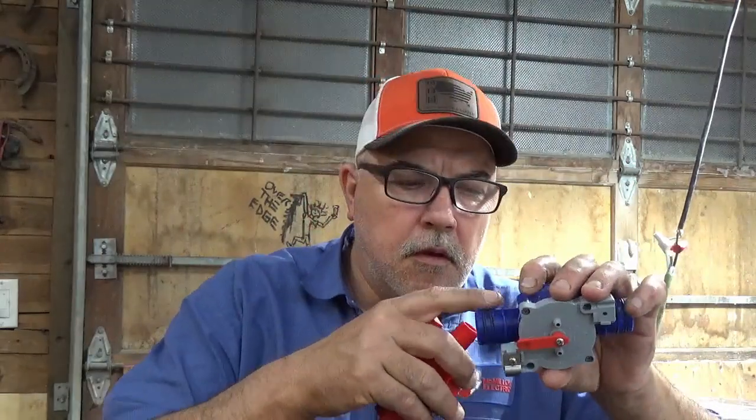I didn't know where he was located in the facility. So I began to explain to him that maybe I'm incorrect, but from my understanding, the opening in the valve is the same size as the 3/4. And he began to tell me, oh no, the opening in the valve is the 1/8". It's got an 1/8 spur fitting on it or whatever, and it's an 1/8". I said, no, the one I got, the opening that's in the center of it is about a 1/2 inch, which is what you'd expect from a 3/4 valve.